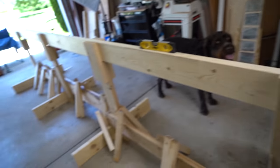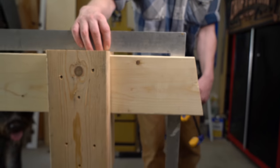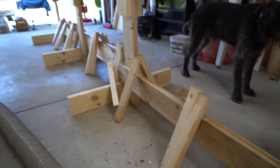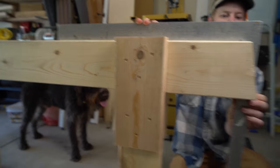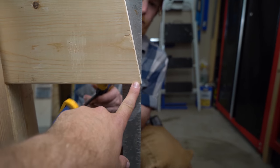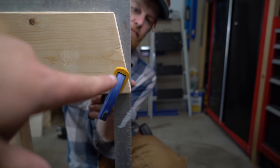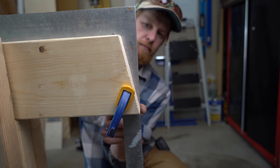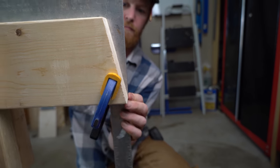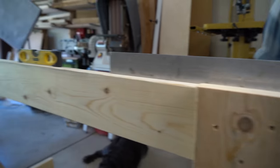All right, so we have our Strongback built and it is nice and level, which is gonna be important for our next step, which is laying out all these bracings that we'll mount the frame to. Little trick we're gonna do, all of our measurements are going off of this long edge of this Strongback, and since it's underneath, it's harder to measure from. So we're gonna clamp a framing square nice and flush with that long edge, hook a tape measure to the top of that, and then we can lay out our measurements all along the top and start screwing this bracing in for our frame.